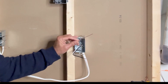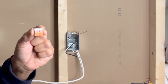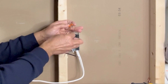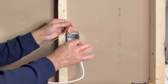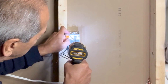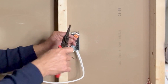Next I will do the ground connection. For that I have taken two five-inch bare copper wires and a three-pin Wago lever nut connector. Open the lever, push the wire all the way in, and then press the lever down. Pull them a bit to make sure they are connected. This wire will be connected to the ground screw inside the metal box. I'll make a small loop here — this ground wire will get connected to the green screw on the outlet.